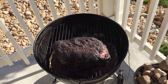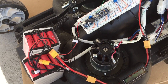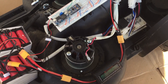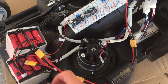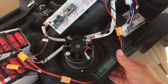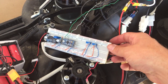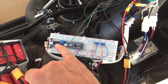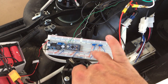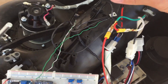All right, here's what we've got. I've done some steps without you just because the wiring — what should have been easy — was kind of insurmountable. But anyway, here's our series two packs, 40 cells, 10s four parallel. Here's the in-between guy. Here's my power supply switcher — we've got some power going in, five volts out. There's the Arduino, two pots, PWM out.